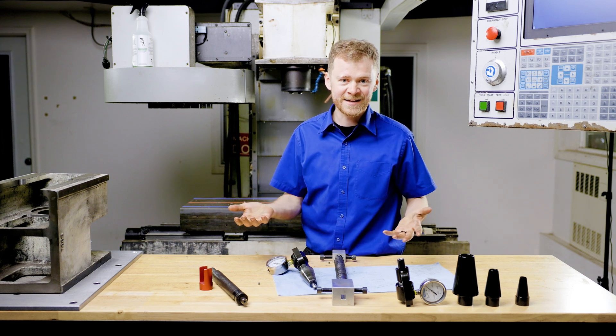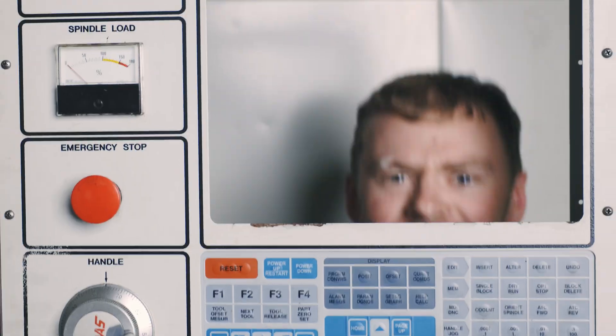And if it comes out and the washers are broken, dead giveaway — you need to rebuild your drawbar. I'm the CNC repairman.